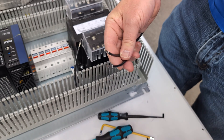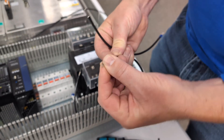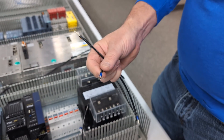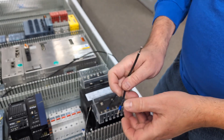I know I said ferrule like everybody knows what a ferrule is, but a ferrule are these things. If we don't put them on, your wires can get all frayed, but if we keep these on, that will keep our wires neatly tight. Do a crimp, and now it's ready to install.